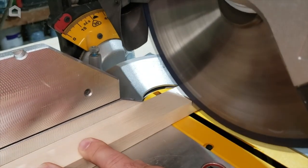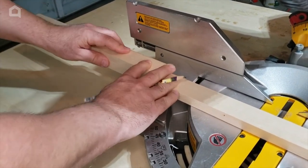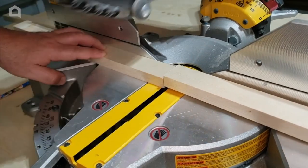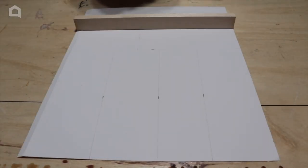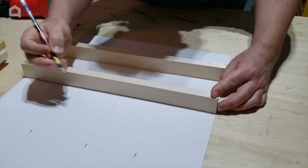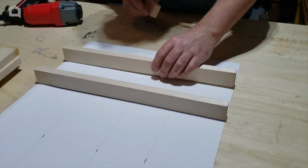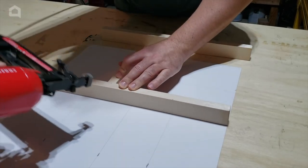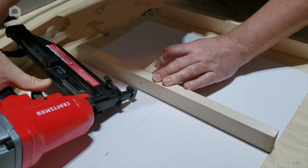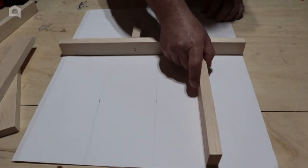Here I am marking my one-by-two piece of board at 17 inches and giving it a cut. I'm using my miter saw, but you can use a regular hand saw on a job this small. Cut the first piece, mark and cut the second piece the same way. Then take your two boards and place them on the outline where they go. Measure the other marks — I got three of them at 11 inches. Once those boards are cut, lightly mark where they're going to go. I have a nail gun so I'm using that; if using screws, go ahead and pre-drill.